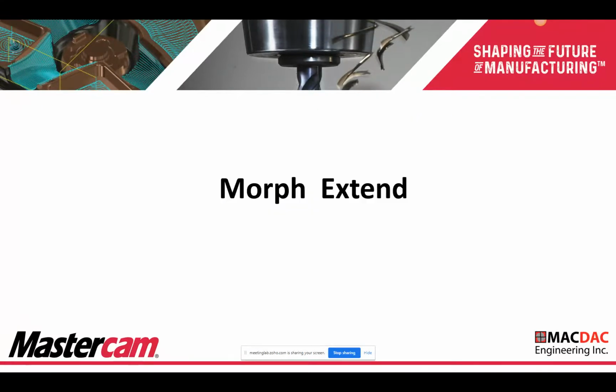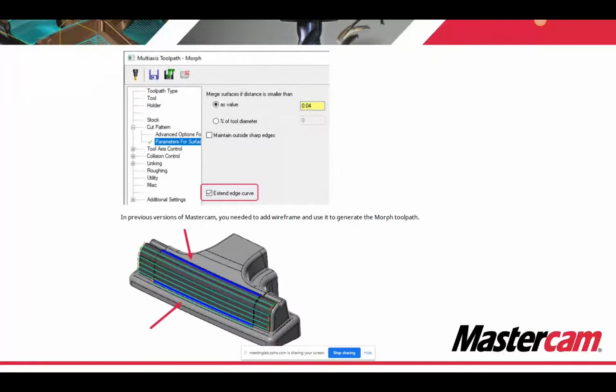Morph Extend. This is probably one of the more used toolpaths that I use for sure. It's super versatile, but it's very much geometry driven. And that's been its best and maybe worst attribute. So as you can see in this picture, we have 2 pieces of wireframe. They're the blue. And with Extend Edge Curve on, it's blending from one to the other, and it's extending out to the edge of the drive surfaces.